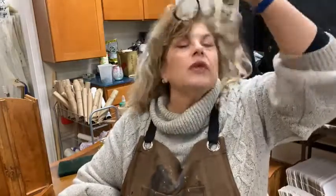I personally make my own shellac so I have the right consistency. Kathy asked about the best way to polish wood furniture — I've seen spray beeswax and think that's lovely, but generally I'm not a furniture waxer. I like to oil wood because the oil penetrates and keeps it fresh and from getting brittle and dry. You can oil and then wax — apply your oil, let it sit in and absorb fully, then come back a day later and wax.